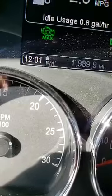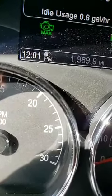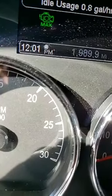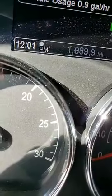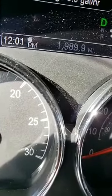Okay? So that's how you can tell. And you can really feel it when you drive these things. You don't need to really look at the dash. You kind of can feel how much compression you got on, but it's just nice to know when you drive around and you don't need the compression brakes or the engine brake on, just turn it off.